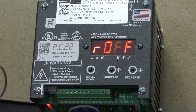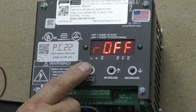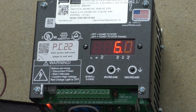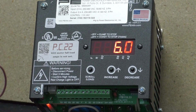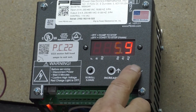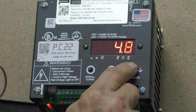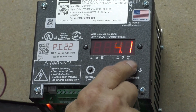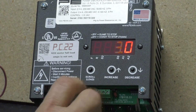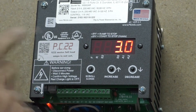To program the speed acceleration, hold down the scroll button until you get to A. Let go — A1. It's programmed for six seconds. I'm going to go to three seconds, so I decrease it until three. Hold down and tap the scroll button — three seconds.